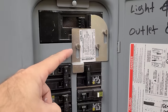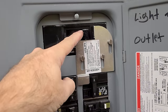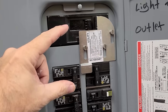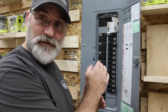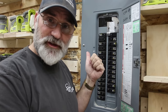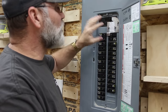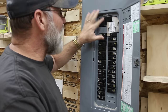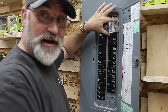This plate right here keeps it so that you can't send power to the grid. Either the main is on or the breaker to the generator is on — the two cannot be on at the same time. Because if you hook the generator up and the main's on, you could push 240 volts right down the line, and the guy working out on the pole trying to fix your power is going to get zapped. So this is a safety measure. It will not allow you to have the generator and the main on at the same time. The main has to be off to turn the generator on. It's a physical block, and this is required by code and by permit.